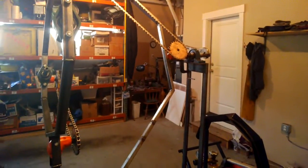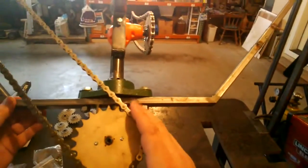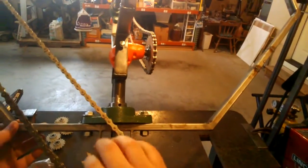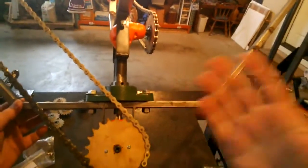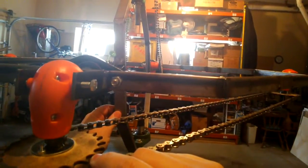I'm working on the gimbal maze prototype. So far I've been using these wood sprockets - laser cut, something I like to do - but it turns out that the torque here is just too high. We've had several chipped teeth already, and I think the problem is only going to get worse. I'm also having a lot of problems with the chain jumping off, and of course that's what's chipping the teeth.